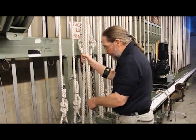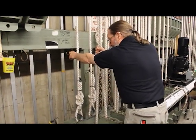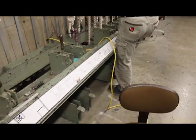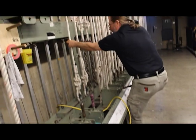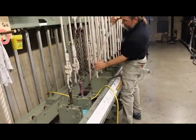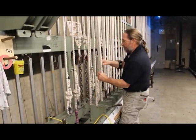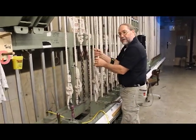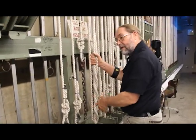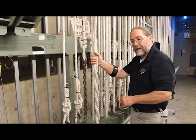In this particular system, they have installed a lift cable on the back of the idler block to help lift it. So if you kick it, as in a single purchase system, and lift at the same time from the back, you can get slack. You can take wraps similarly to what you do in a single purchase system — but it's just heavier and larger, not quite as convenient to use.